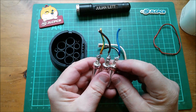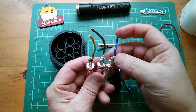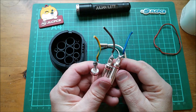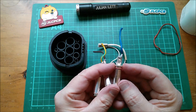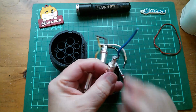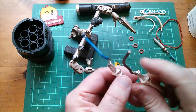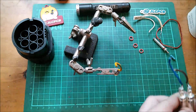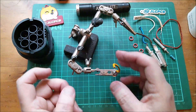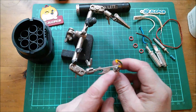The high current connectors for live, neutral, and earth have all been crimped with a high-pressure crimper but also soldered, which is a bit odd. I'm wondering if they repurposed an old connector that was previously crimped and then just soldered new wires in. For a charging cable you absolutely would not solder high current connectors — you'd crimp them. But for a V2L cable where the current is limited, soldering is probably okay, especially since this is just mine.